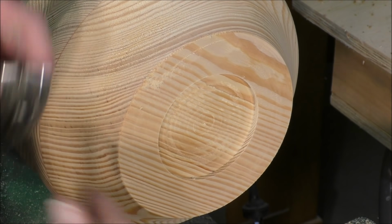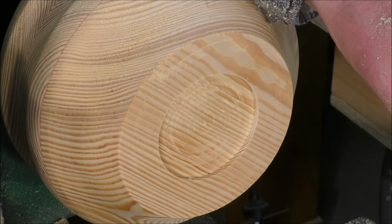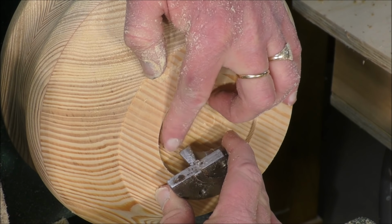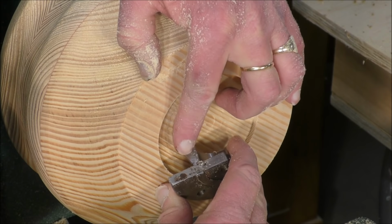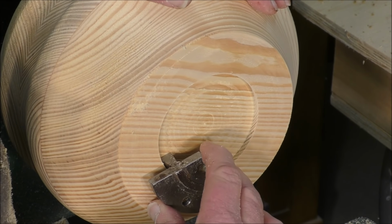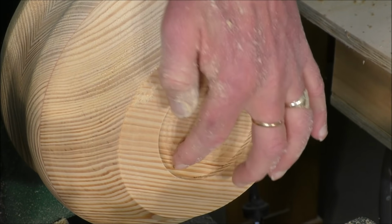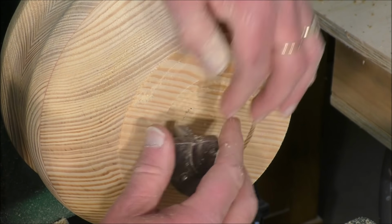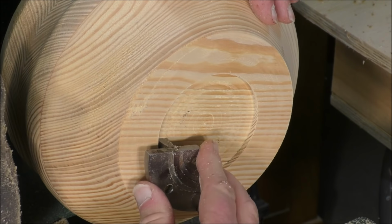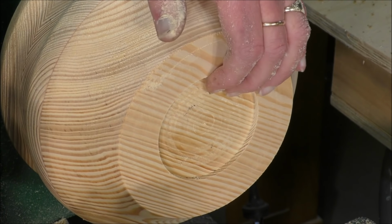Okay, so you can see now that I've machined into here an angular lip inside there. Now that angular lip, if you notice, is the same angle as the grip or tooth of this jaw. So when this opens out, it grips and pulls in that way. This surface here is hard up against the wood, and as it's been pulled out this way, it's actually pushing further in that way, so it's grabbing it tighter and tighter. I hope you can see that action there. So that's the idea of a tenon.